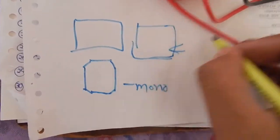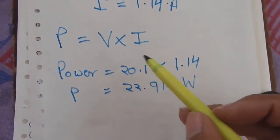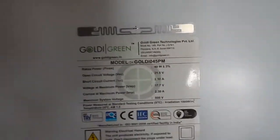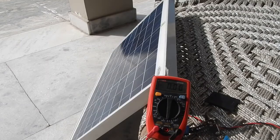So that's how polycrystalline cells look and that's how monocrystalline cells look. To summarize: to calculate the power of a solar panel, you measure the voltage, measure the current, and multiply them together. At the back of the solar panel you can see the Goldy Green logo and the characteristics label. That was my review of the Goldy Green 40-watt solar panel. Hope to see you in the next video — bye!